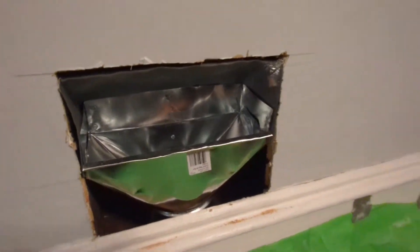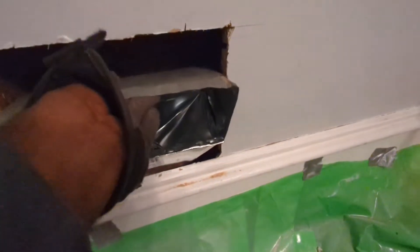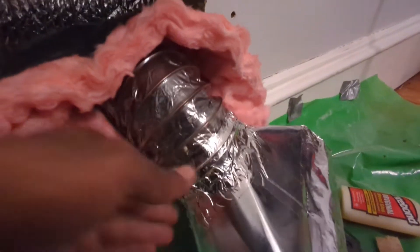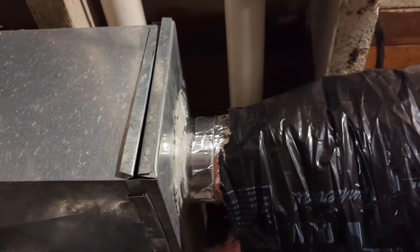This is a portion I haven't taken out yet, but it's going to look the same after I take it out. First I put material down to collect all the debris, then I use a multi-tool to cut out the hole — they're all slightly bigger than what the vent is going to be to have a chamfer to fit it in. I had to custom make some parts because I couldn't find an exact match at the store. Then I make sure I seal everything, add the insulated duct tube, zip tie the insulated part onto it, then connect the other end to the vent return.